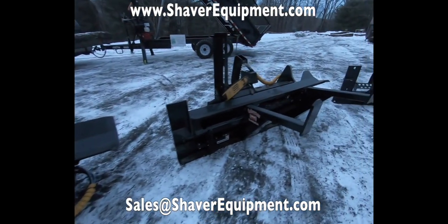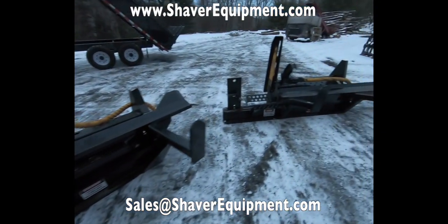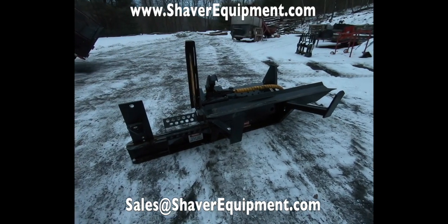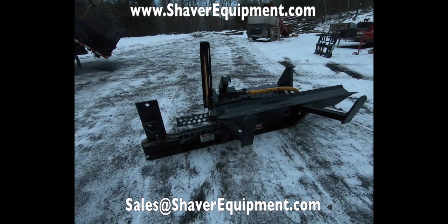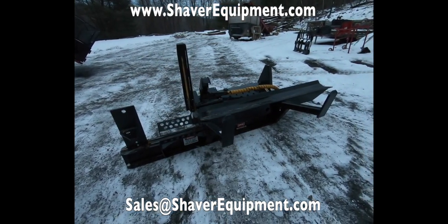The 130s were slightly slower, maybe 1 cord to 1.5 cords an hour, and the 120 does offer about 3/4 of a cord to maybe 1.5 cords an hour. It's just a little bit different with the saw motor being on the inside, and the splitting cylinder is a little bit smaller, so you do get a little bit of a drop in the cord count.